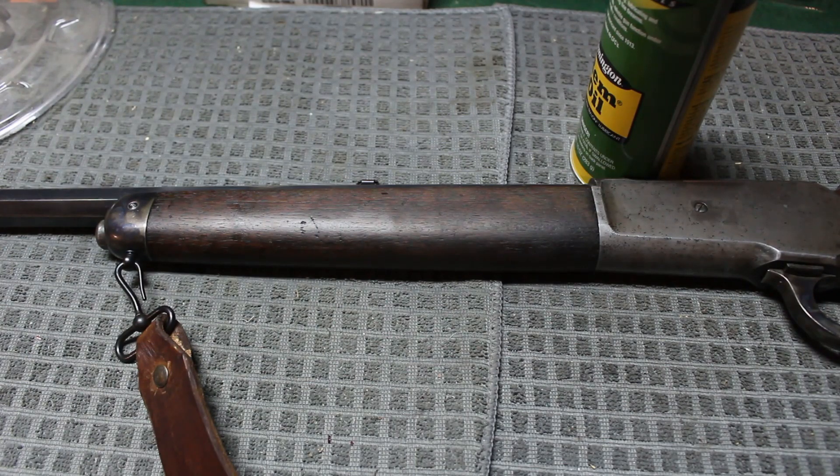This is a really quick process — only takes a few minutes including assembly. This is a really simple way to do this at home; it's what gunsmiths do. The only other way to fix a dovetail is to weld it back up and use a milling machine, or use a specialty file to refile it. I've watched multiple videos and looked on forums — extremely light taps and you try the dovetail fit every single time. If it's too tight you might need small jeweler's files, which can get expensive. But the aluminum foil method is extremely simple, only takes a couple minutes, and the foil is only a few dollars at the grocery store or dollar store. That's my two cents — thanks for watching.